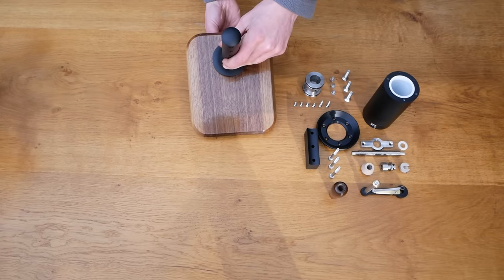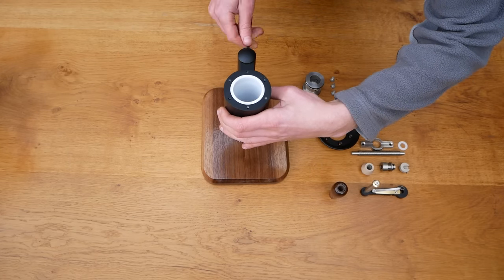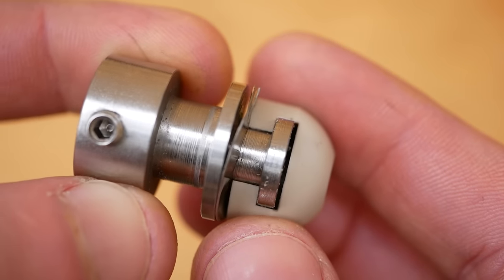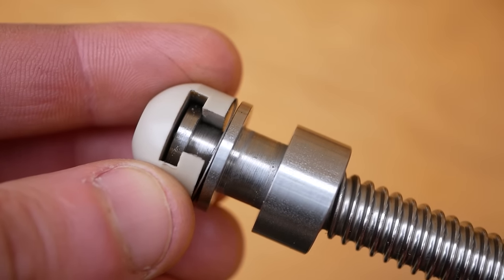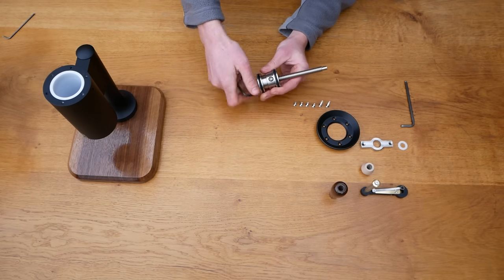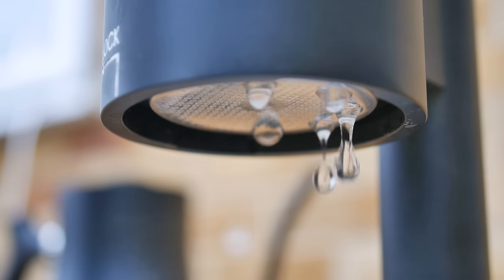The Helix is very similar in many respects, so I will run through this quickly. The pillar is shorter on the Helix, and for variety we decided to use a walnut base rather than a granite one. Rather than a conrod, here we use a lead screw. We designed a mechanism to fit onto the bottom of the lead screw which allows us to fit the hemispherical component from the side, thus negating the need for an o-ring, which we wanted to avoid as the lead screw must rotate relative to the hemispherical component. The leaf spring allows a tiny amount of movement, which is necessary due to the higher thermal expansion coefficient of the aluminium cylinder relative to the stainless steel lead screw. Without this spring, the cylinder effectively stretches slightly, resulting in a slight leak during the warm-up phase.